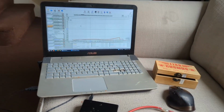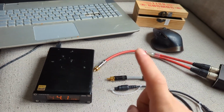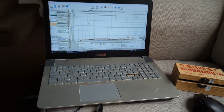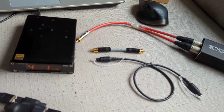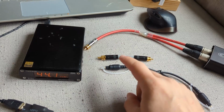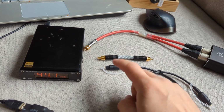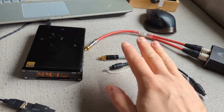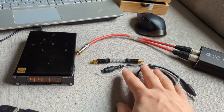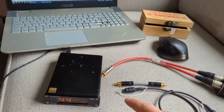So if you were watching my previous videos, you saw that I am measuring amplifiers and DSPs with the Focusrite audio interface. Now, for the amplifiers, it's plenty enough because the THD is way below. The Focusrite has a lower THD than the amplifiers. However, for DSPs, I received the Helix DSP Pro Mark III, which I know is going to measure very, very good, and I have that Alpine 0850X that I know is going to measure good as well. So I know that potentially I could bottom out the Focusrite, and I needed something better.